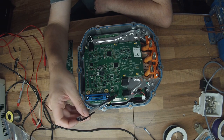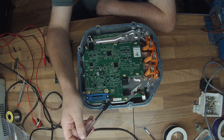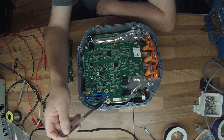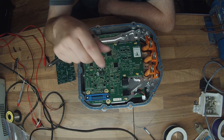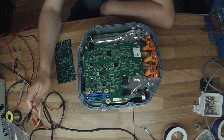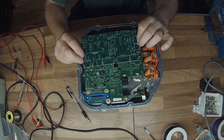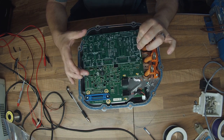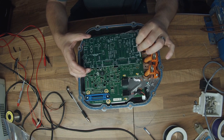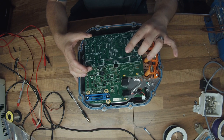There looks to be a kind of a multiway connector - 24 pins - that connects the logic board to the drivers and so on underneath. 24 pins is kind of interesting because on the large drive unit they happen to use a 24 pin JST connector for connecting to the IGBT drivers, so there could be similarities. From a kind of overview of the PCB, there are three large QFP packages.